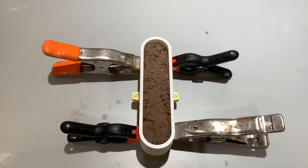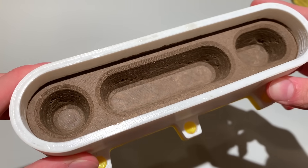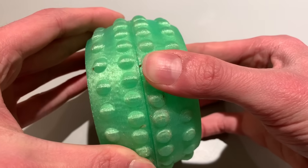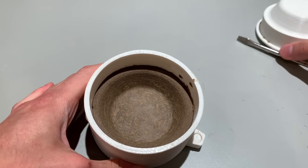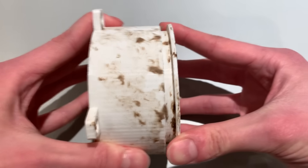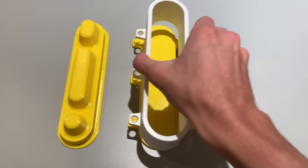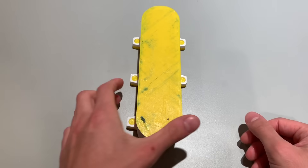The first step is creating a mold. The mold's job is to take the high-volume pulp and compress it down into the desired form. My first experiment was a two-part disc mold, which had two main issues. The paper pulp shrinks dramatically when you compact it because about half the volume is water, so the press needs a long range of motion. Secondly, with a two-part mold, it's hard to remove the finished object. So I settled on a generic three-part mold design consisting of a base, an interlocking perpendicular and straight wall, and a press tool that can slide freely inside the wall.